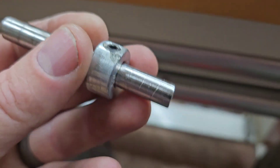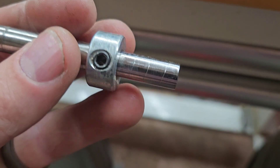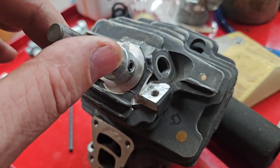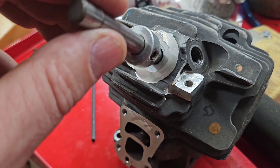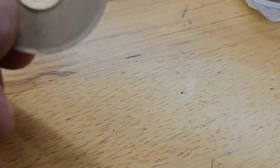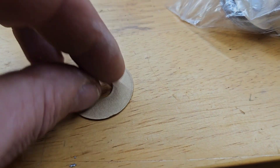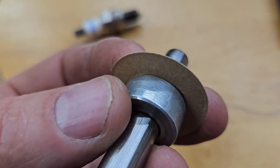All right, there we have it. That swirl you're seeing is because I didn't back my cutter out before I moved the table down — whatever. So that's what it is; just had to machine a little bit off of it. Now it fits right down in there just right. I'll still have to have a steady hand because it does want to rock back and forth, which is surprising. I'll put some tape on that — give that a try. Turns out I've got these little sticky sanding discs that came with something. I'm going to put them on and trim off the excess.